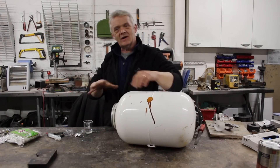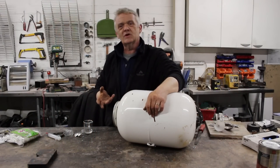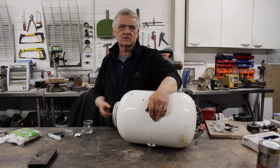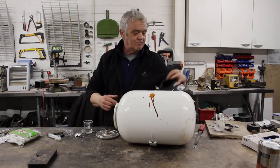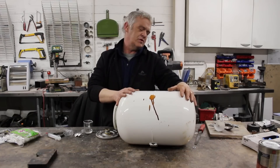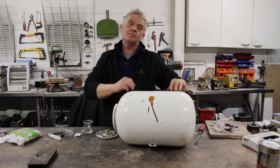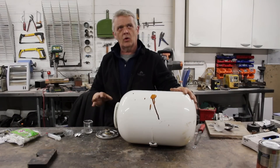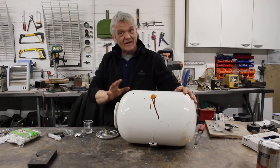That's the idea of what an accumulator is, and it transitioned from that small syringe to giant brick and steel structures. This, however, is a modern accumulator — we still use them today for evening out water pressure in low-pressure zones, when running from a well, or at a distance from the water main. These are essentially a steel tank with a cap, and inside that cap is a balloon made of EPDM. This particular one gets charged to 50.7 psi; you fill the balloon with water and it exerts pressure against the air already in there, giving an overall pressure of 145 psi. Bearing in mind that static head is 1.42 psi per metre raised, that's equivalent to around 100 metres of static head — pretty impressive.